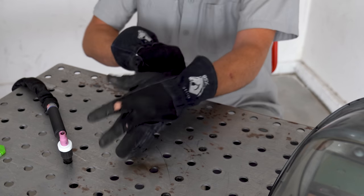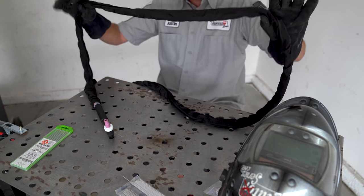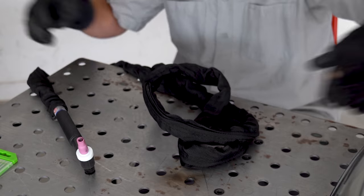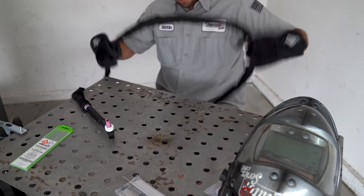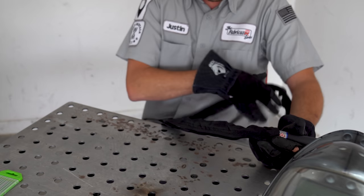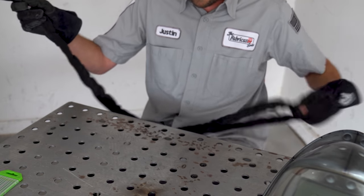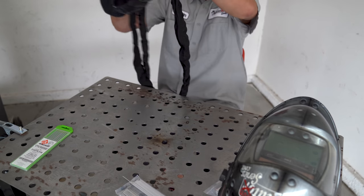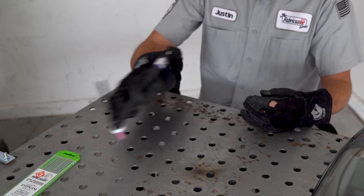First and foremost, get your gear on and your gloves on. Make sure that your lead — which is the whole line for the torch — is not all bunched up or in knots. It's got to be kind of straight flowing. You can throw it on the floor, grab some slack, and just throw it in your lap. You want the slack of the lead to not pull off your lap, so get it in a spot where it's not going to pull the torch out of your hand.